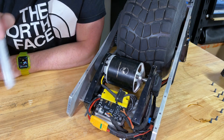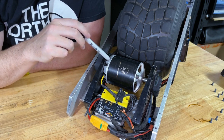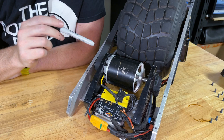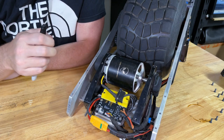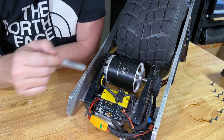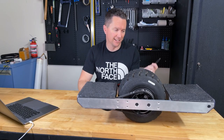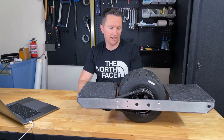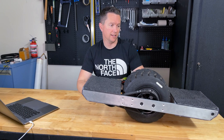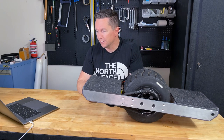I took it for a ride the other day — a long ride on a 37-degree day. This motor doesn't have a temperature sensor, something I'll probably change soon. Halfway through the ride I reached in and touched the outside of the motor mount and it was very hot — hot enough not to be able to touch for too long. Interestingly, I could also feel the frame out at the ends was also very hot, so the thermal conductivity is actually working as planned, which is nice. The board balances well too — heavy battery at one end, heavy motor at the other.